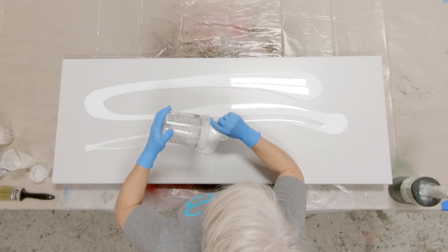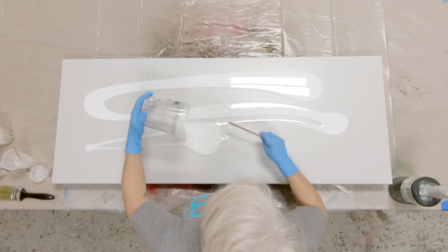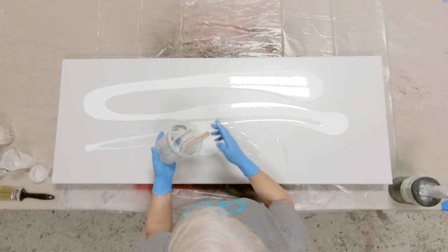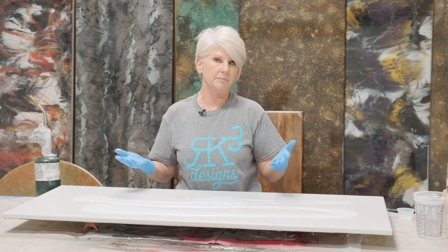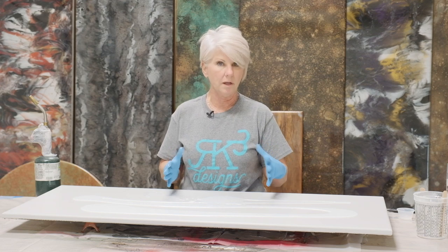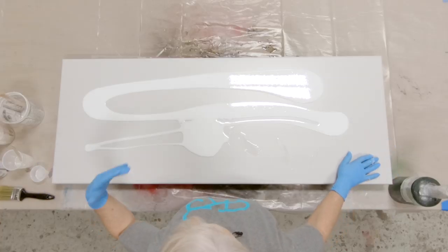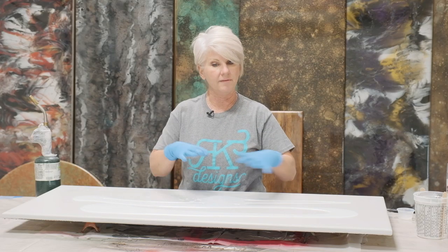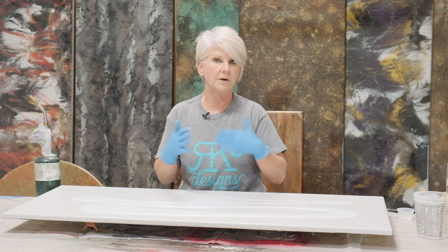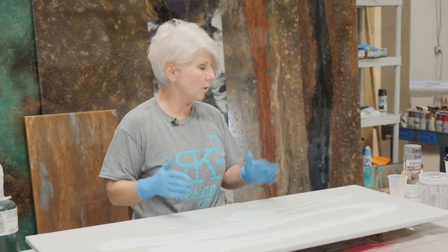And you're noticing I'm doing my samples today on a little bit bigger sample board. If you are doing this, whether as a DIYer in your own kitchen or even as a professional, you need to get used to doing your samples on bigger size boards, because you can do a sample and get it really pretty on a very small board. But when you take that pattern and finish and put it on something bigger, even if it's just a bigger sample board or a big countertop, you now have an element of size that's either working for or against you. So once you find a finish that you really like, practice on it two or three times. Make sure it's recreatable, and make sure it's recreatable at scale. So we're gonna see if this works.